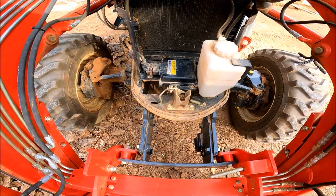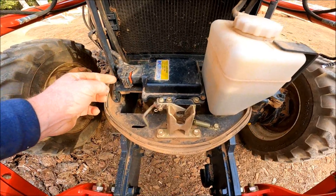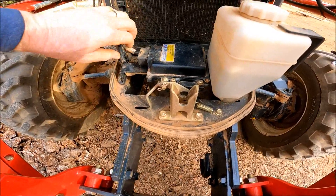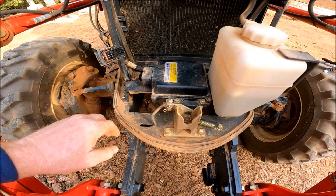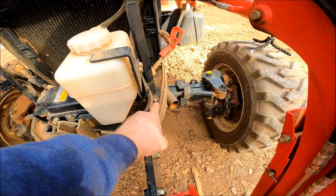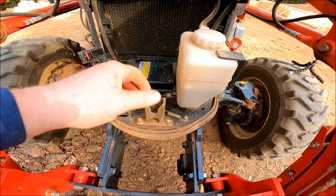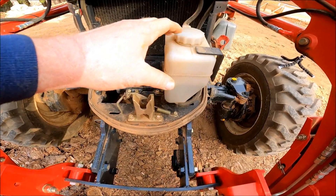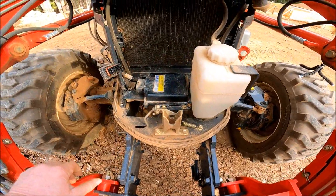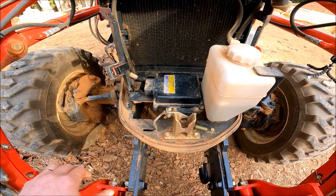In order to get the battery out, I had to disconnect this electrical connection. You just push a little tab here, this part rolls down, and the electrical connection pops out — I think that's kind of like the computer brain for the tractor. Then there's a bolt on each side with a 12 millimeter head, and once those are undone the battery bracket comes out and you can swing it out of the way. The battery bracket also holds the overflow for the radiator and the computer brain.